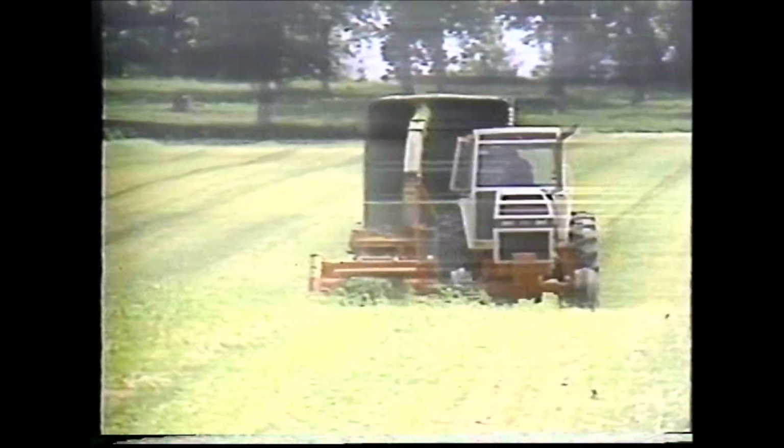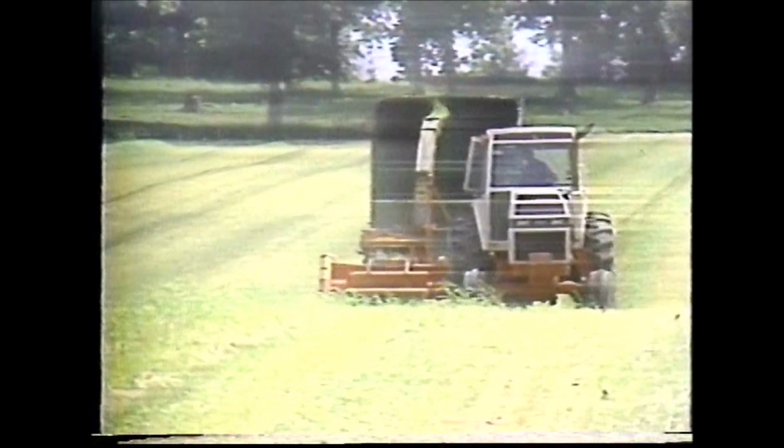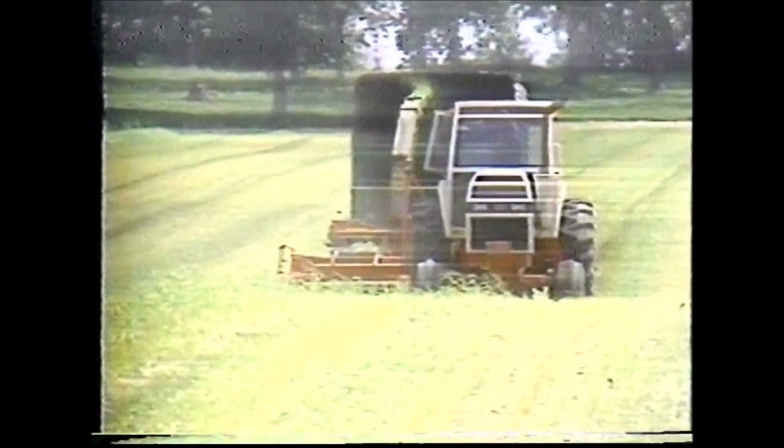The other thing we don't want the customer to do is lug the engine down until it almost kills before they push in the inching pedal. Why? Because at this point the engine has reached peak torque, and when you push in that inching pedal and reverse the planetary, you're putting a tremendous shock load on the torque limiter. If you do this very often, it will shorten the life of the torque limiter.